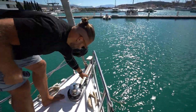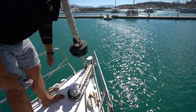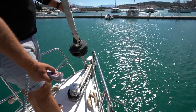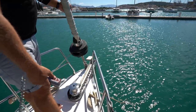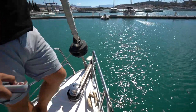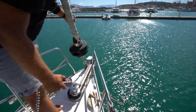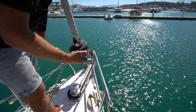The anchor chain is marked at 10-metre increments with colours — 10 metres is blue, then another colour at 20, 30 and 40. When bringing your anchor up, never strain the anchor windlass. If you hear the windlass strain, stop, wait for the boat to get closer to the anchor and then start again. When bringing the anchor up, be very careful at the last part to go nice and slow so it does not swing and hit the hull. The last part coming over the roller can be quite violent, so do it with small presses.